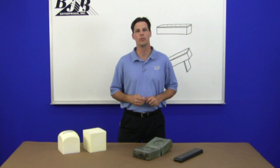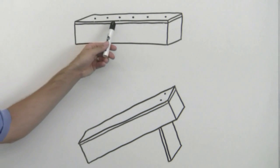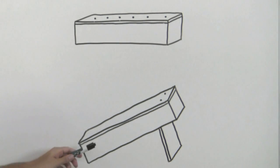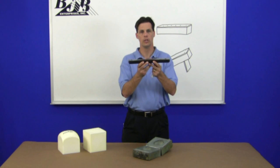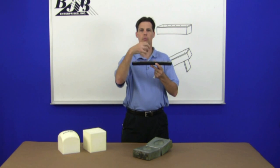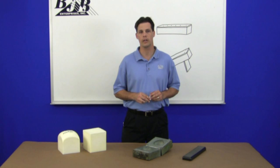The other component to proper mold design concerns orientation — positioning the mold to control the flow of expanding foam towards the vents. On a part like a thin armrest, it might seem logical to add multiple vents, but in reality it'd be better to have a couple of vents near the extreme corners of the part and angle the mold so the vents are at the high point. Fewer vents allow more back pressure to build and form a nicer skin. If you cast the mold flat and level, the foam would rise upward and close out the vents before all the air is displaced — this trapped air can be forced back into the part, causing voids and inconsistent cell structure. Angling the mold uses gravity and the natural growth of the foam to direct air out in an organized manner.